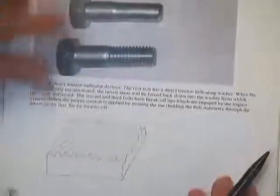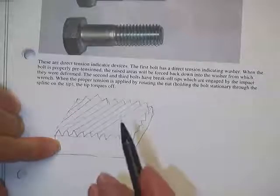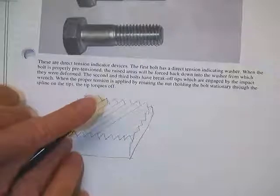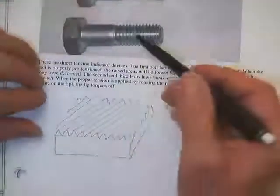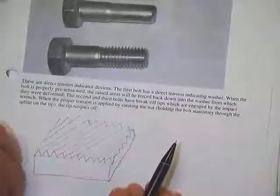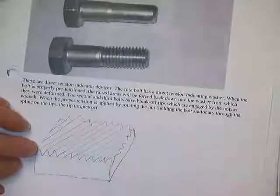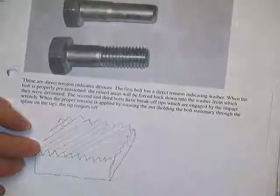The way they do it is they'll take one of these blocks, it's clamped to the base, they'll take one of these and turn it upside down, so they both run the same way, but one is off by half a thread, and they just mash the bolt, and they put just this on the top and just that on the bottom. Then they take these two things and they go, and the bolt drops out, drops out, drops out. Really nifty. And so they actually are forming these threads. They're not cutting them. That, of course, is better for the bolt, too. It makes it stronger than having cutting tool marks down in the bottom.